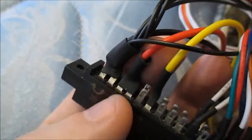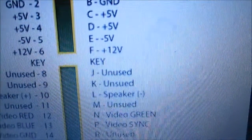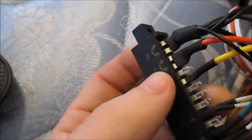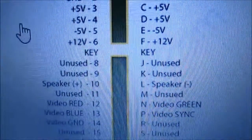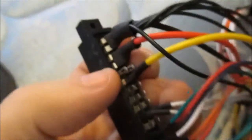Not every one of these pins is even being used. What they did here is they just tapped off all four and used a big wire instead of running four individual wires, which is fine. But some harnesses may have four individual wires coming out. Instead of running four wires for plus five, they ran one big wire. Same for the plus twelve volts — instead of running two individual wires, they just tapped off both sides and ran one wire.